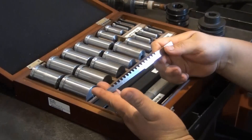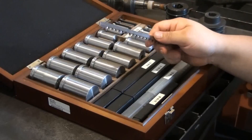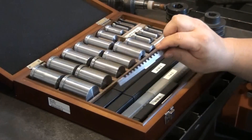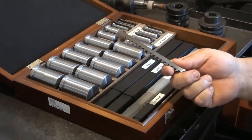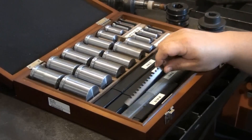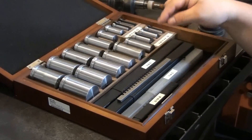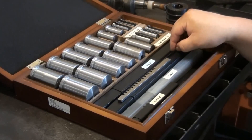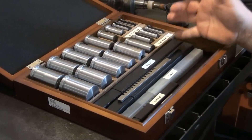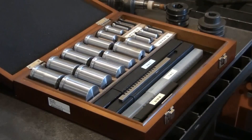It's good to have a quality or at least tight enough press to actually do broaching. Since the broach is made out of high-speed steel, it's very strong but also very brittle — a sudden drop on concrete or metal could crack it, break it in half, or shatter it. This is less of a concern with smaller broaches, but larger, heavier broaches are at more risk from falls.